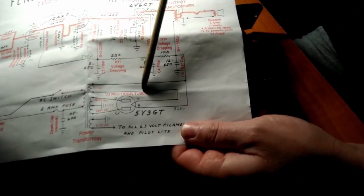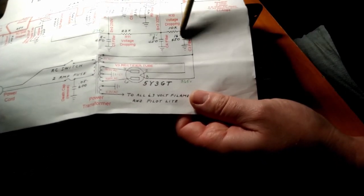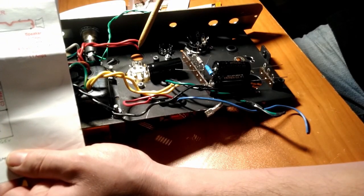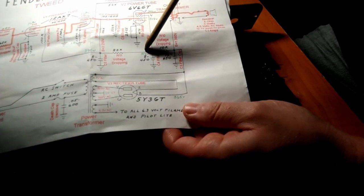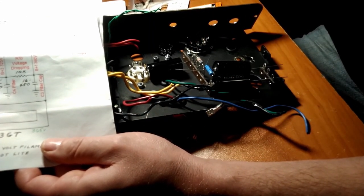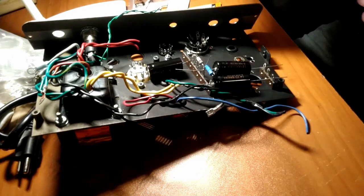And if you can see here, we're going to have 365 volts of DC going through this part of the circuit here. And this 10K resistor right here, which is going to be this guy right here, he's going to be lowering the voltage from 365 down to 317. So he's basically taking voltage, turning some of it into heat, and then passing on what's left over. And you want these to be very robust in this position here.